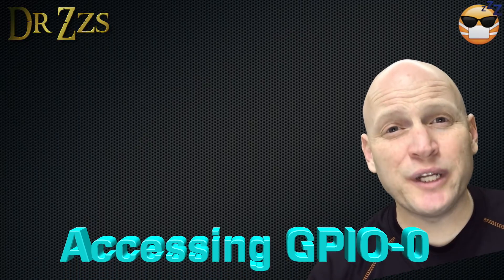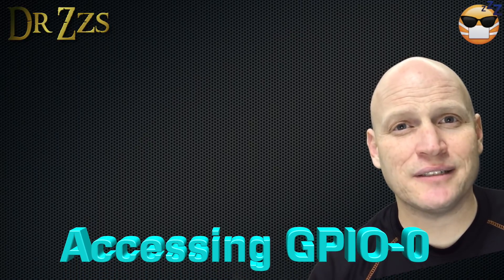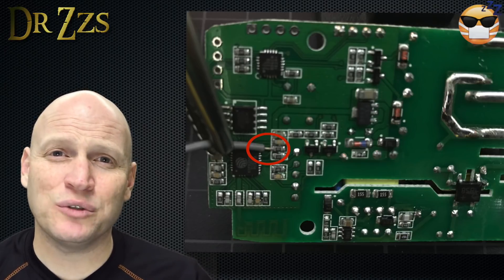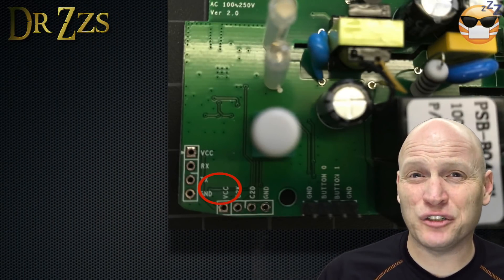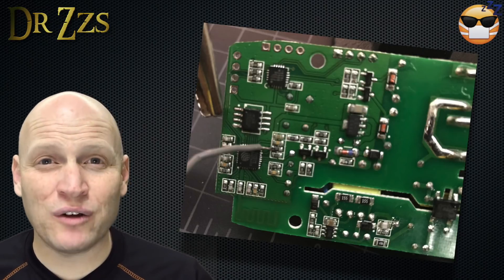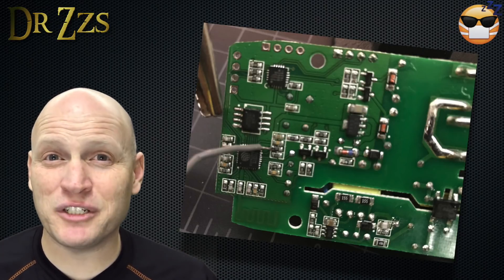On the original Dual, it's really hard to get to the GPIO0 pin. There are two places where you can access it. One is on the bottom side of the board — a tiny little pad next to a resistor right here. The other way is to scrape the coating off of a conductor track on the board. Neither one of those is a great option. I went with the soldering route, and it was a major pain — well over an hour trying to solder a wire to that tiny little pad. There just isn't much there to solder to.